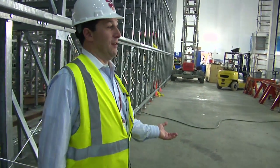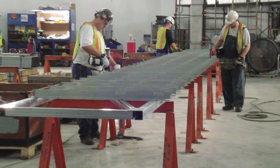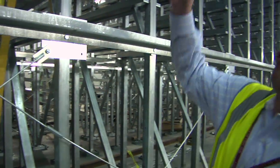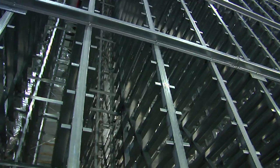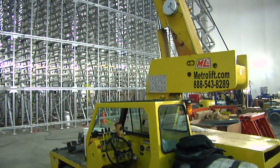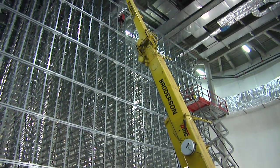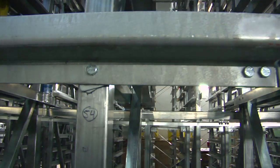To give a little bit of an idea of how this is actually constructed — it all comes out in pieces, and it's essentially, like when you were a little kid, an erector set. All the pieces and parts are laid out here on the floor, and they have an assembly line. All the pieces you see here are unassembled and are bolted together. We have one line all the way up that gets erected in place at a time. It gets fastened at the bottom and at the top, and raised up by the small crane we have here. The crane takes these pieces and sets them into place, and then the iron workers come in and bolt them to the bottom and top.